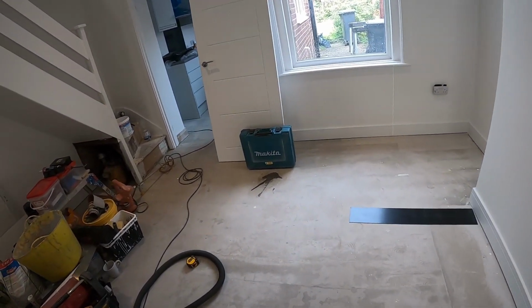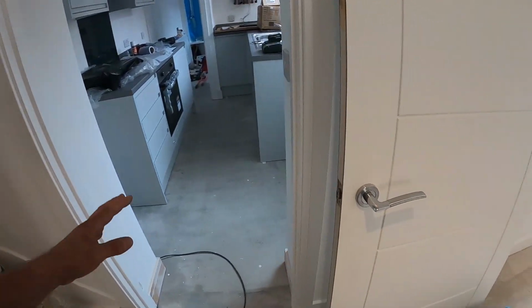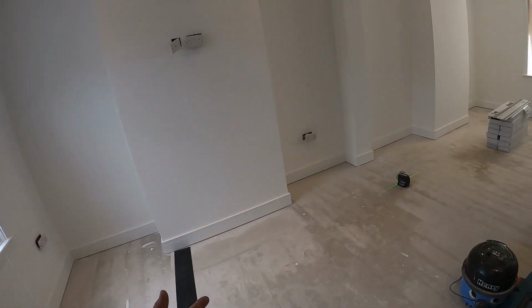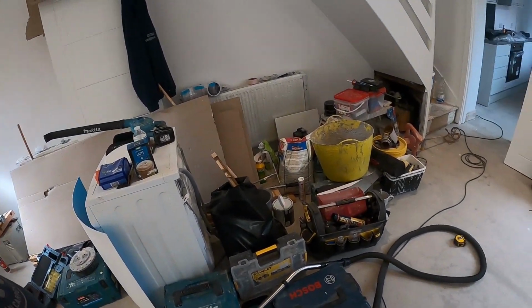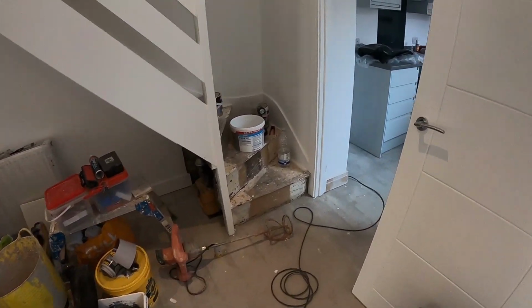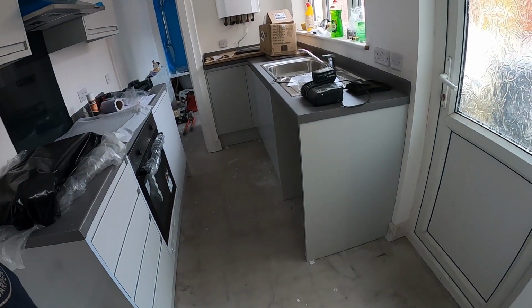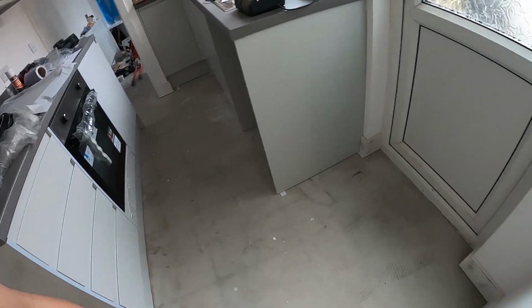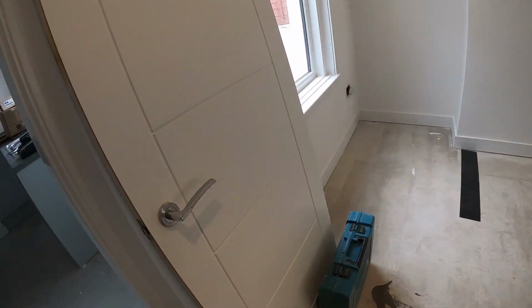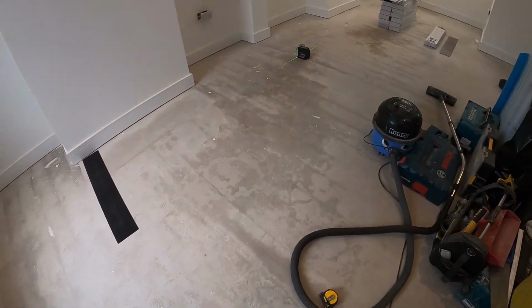or any kind of floor, it's always the case. You're probably going to have a question, why I didn't plywood it all. Well, I would have if the floor wasn't as good as it was. You would probably have to put like 9mm ply, but the trouble is that would mean you would have to stick tile board or something here to bring the floor level, because that's where it joins, that's the concrete floor. But I wanted it, if possible, I was hoping that we can just do that, and it has worked.